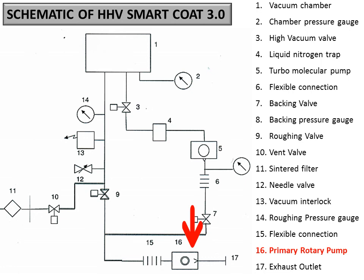When you turn on the system, you should turn on the two Pirani gauges and this rotary pump at the very first moment. So when you turn on the rotary, you should turn on the two gauges. Then you operate valve number 7 or 9 to make the pressure arrangements, where you want to connect this rotary for pumping. Initially, we connect the rotary to 9, means roughing to the chamber. When we get sufficiently low pressure inside the chamber, we connect the rotary to the backing line of the turbo. And when it reaches less than 5e-2 millibar, we turn on the turbo pump